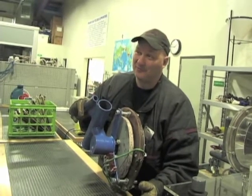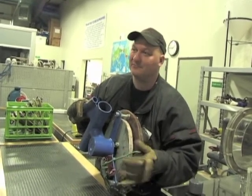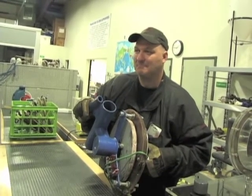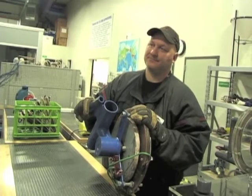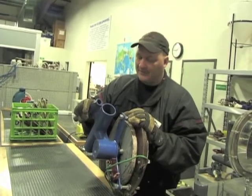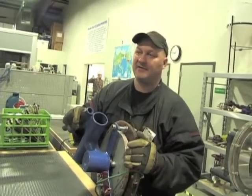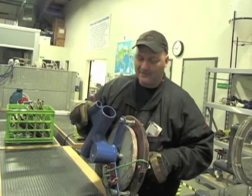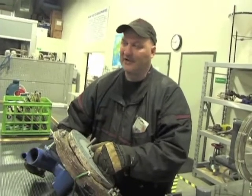With the 3Ks producing about 100 volts per phase, when we spun it with just one phase, it actually lit an AC bulb. ABS Alaska has DC washers for fish camp, DC refrigerators, DC freezers. Conceivably you could power the freezer in summer while people are cutting fish. But DC stuff is expensive — personally, I think it's cheaper to take the DC, put it in a battery bank, and convert it back to AC with an inverter. Most stuff purchased in America runs off AC.